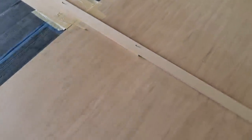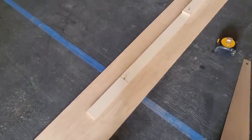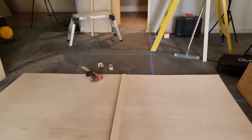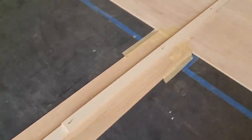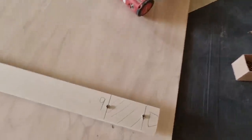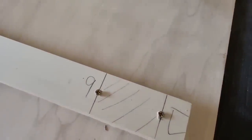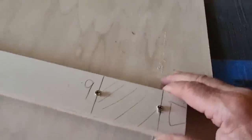I've got a sheet of ply, an offcut of ply, and I've made a trammel - basically a long straight stick. I've got an axis centre there which is just a screw that screws straight into that bit of ply, and then I've set the first radius with two screws here, which enables me to use the screws as cutting edges and pull it round. You can see it's giving me a really nicely scribed radius.